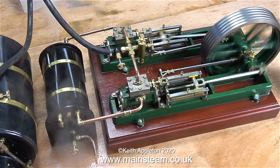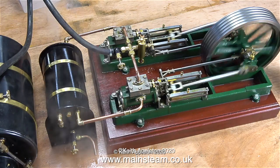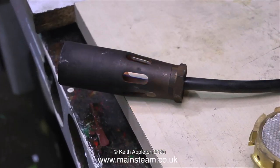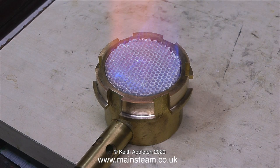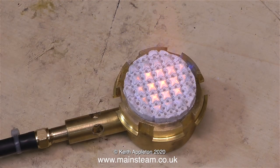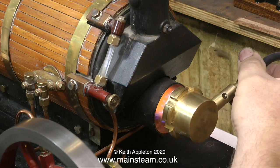Before gas firing became popular, many weird and wonderful designs of burner were out there — most were like modified paraffin blow lamps, and some even used petrol. These days gas firing is very convenient for firing model boilers; if you get into trouble with low water you can just turn the gas off — an instant cut-off of the heat source. This was the later type of Mac Steam burner, and I changed the ceramic for an earlier type. You can see the difference — this type of ceramic burns a lot hotter, and is far better. I found it worked much better if I pulled it out slightly from the flue tube.